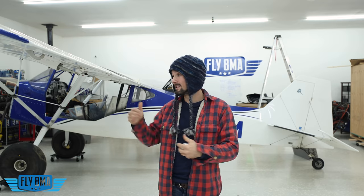So what are the main takeaways? Ultimately, the single most important thing to know is that when you pull an airplane that is warm out of a hangar, don't be in a rush. You've got 30 minutes, an hour, two hours — say you forgot to file a flight plan, you forgot some stuff in the car, or you have to run back in. No need to rush. That airplane is doing just fine, even if it's zero degrees out there. Now if it's zero degrees or 20 below and blowing 20 — which you probably wouldn't be going flying in anyways — you might want to get it within 30 minutes or so. But even if you fire that thing up after 60 to 90 minutes, I wouldn't feel that bad about it, especially if you had taken it out of the hangar with an engine blanket still on it.